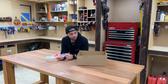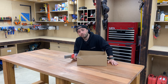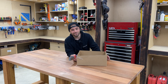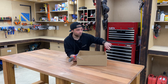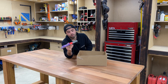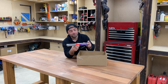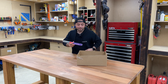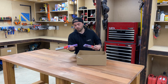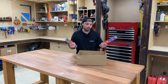On the left side of the bench I'm going to put a series of drawers. I'm going to try and do a double-sided drawer system, so I have drawers coming out on this side and drawers coming out on that side. I've got these 300mm soft-close drawer runners — I didn't even realize I'd bought soft-close ones. I just have to make sure I allow enough space behind them, but I've worked that out so it should be right.